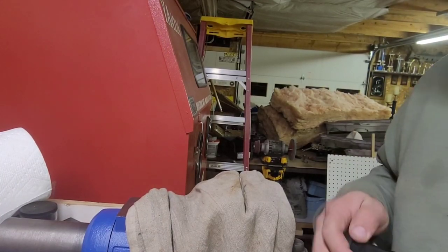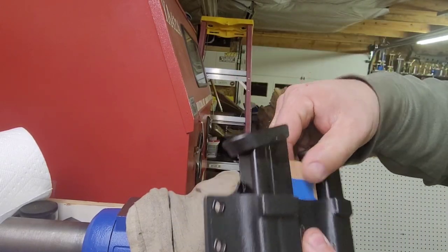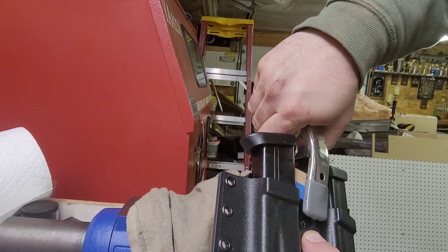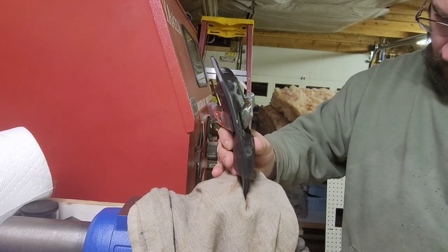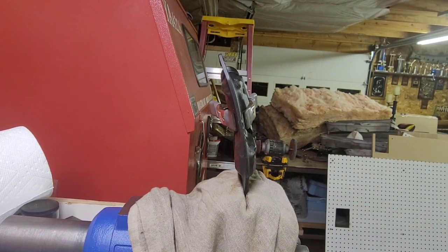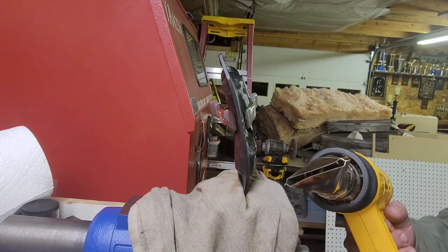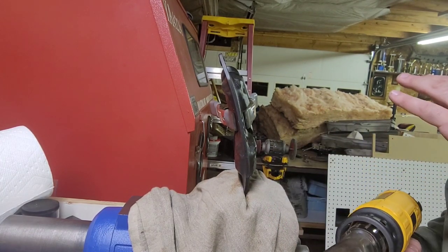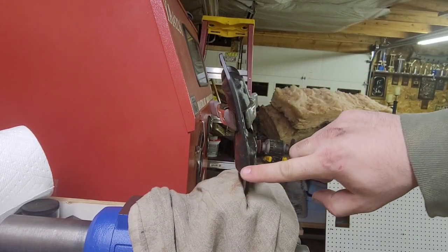All right, so mags in, okay. Put the retention plate in that we had. Lock that in place. Go ahead and set this up like you would bend any normal holster. If you don't have a strip heater, mount the wing in a vise and use a heat gun that has this attachment. You'll be fine every single time. So obviously you can see that this has a nice curve to it already, thanks to the HD Design jig.